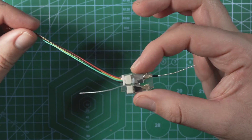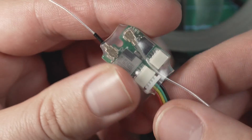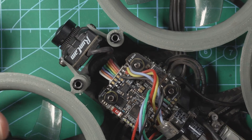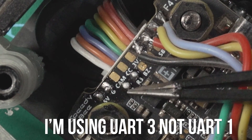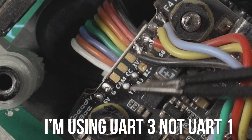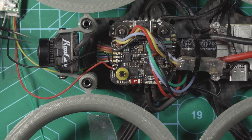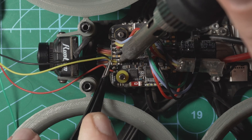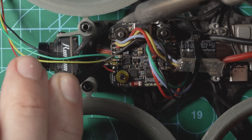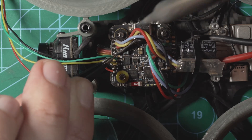Now the BS module is ready to go into the drone. The BS module supports 3.3 to 17 volts, so I'm going to hook it up to a 5-volt pad. I'm going to use the two middle wires — the green and yellow wires — for TX and RX, since this can double as a GPS. So I'm soldering to 5-volt, ground, T1, and R1: yellow goes to TX and green goes to RX. Now the remote ID module is hooked up to the drone.